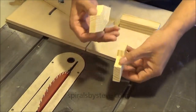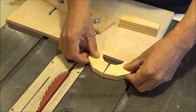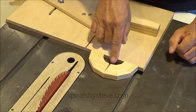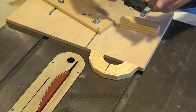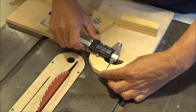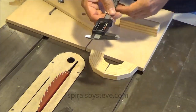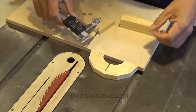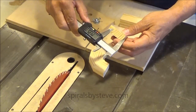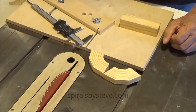As you can see here, I'm pushing these segments up against this straight edge to act as the center line, and just bringing them together until they touch. And as you can see, I've got a big gap right here on the inside — and that's big enough I can measure it with calipers. I'm getting 0.139 as the gap, and the width of the joint is 1.434.